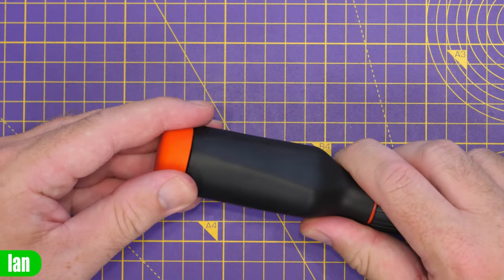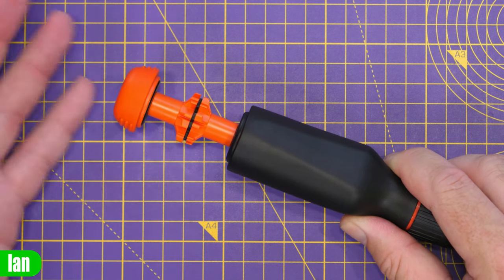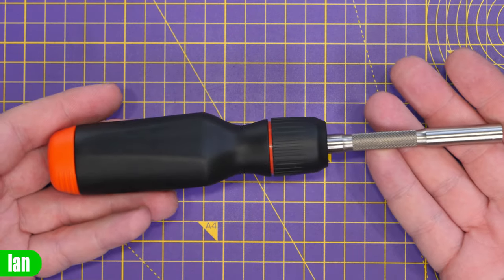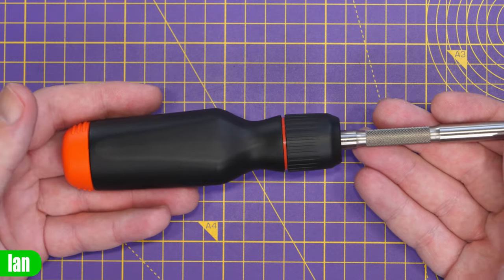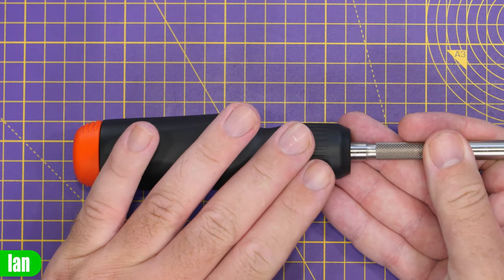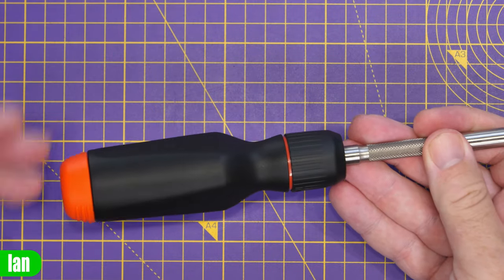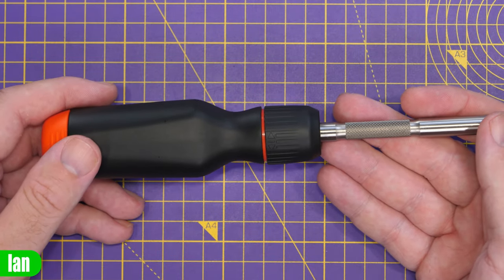We've got a plastic handle in the centre and magnetic bit storage on top. That bit storage is based on the Mega Pro design and holds up to 12 of Linus's short bits, or standard bits at reduced capacity of six. Materials-wise, everything is really nice and high quality — stainless steel shaft, and external plastics in the wear areas are made from Triax 1120, a tough nylon ABS polymer. The ratchet mechanism is also based on the Mega Pro ratchet — tried and tested — modified for a lighter feel but offering reassurance of durability and 220 inch-pounds of force capability.